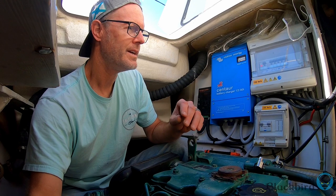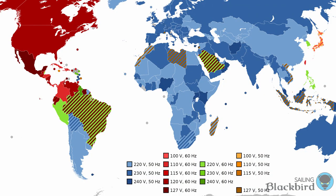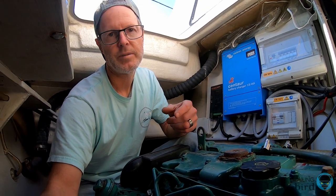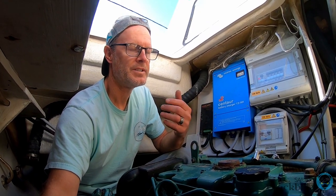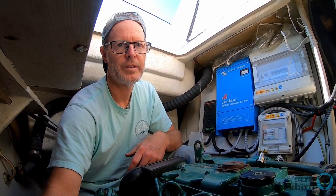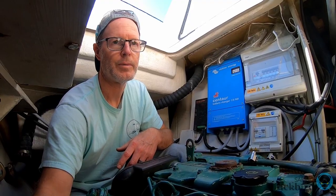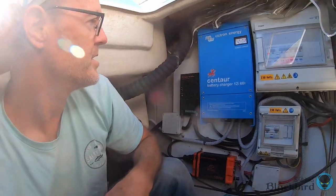The reason we did that is because there's a lot of equipment on board that runs 230 volts, though we're North American and all of our personal possessions run on 110. We needed 110 so we don't have to replace everything we own, and we didn't want to replace the boat's native equipment either. It ends up being cheaper to just buy two inverters, and it increases versatility — if guests come from Europe or other 230-volt countries, they can plug in on the boat.